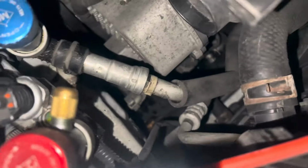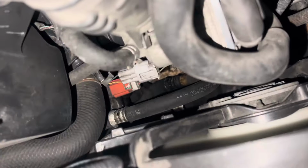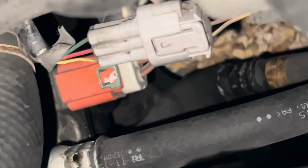And if you could see way down there, I don't know if my camera could catch that down there. Let's see if I can put the tips. See that shadow where the tip is? That's my compressor. And if you look at it really carefully, it's wet because it's cold. All over my compressor, it's wet. My compressor is dripping. If you look over on this side of the compressor, down below that black, below the orange fitting, do you see the water down there? Do you see the wet down there?